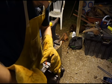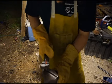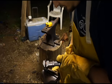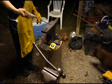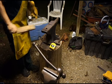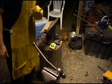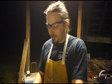Here we are. Once we twist it, if it comes out a little crooked, you bring it over the anvil and smack it with this little piece of wood — that way I'm not marring any surfaces. The cool thing about running a little setup like this is you can heat specific points of your work, which is great for a project like this where I'm twisting small sections here and there.